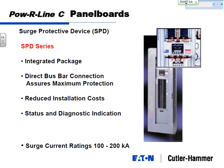And anything higher than that, inside this surge protective device, there are little MOVs, metal oxide varistors that open and close. As soon as you break that threshold, it'll open and shunt all the current to ground until it goes away, and then it'll shut, and the normal current goes on through. So it chops off the top of the transient voltage. Correct. Yep. Just takes off the excess. Bleeds it off, I guess, is a good way to think about it. And it cleans up that voltage so it's usually within the design parameters of your load side equipment.